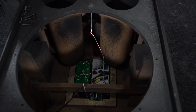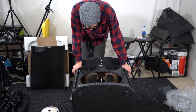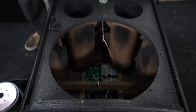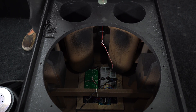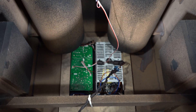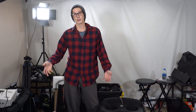Looking inside the box, my guess was correct — it sounds boomy because there is no acoustic fill or polyfill in there at all. It's a completely open box. They did brace it well, I'll give them that. The amplifier network is a truly digital amplifier — no Class A or Class AB going on here, just a fairly small circuit. That may also be why we toasted the driver: it may have sent straight DC when it clipped hard.